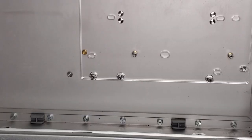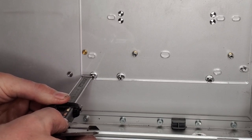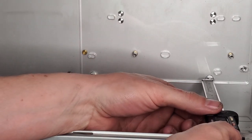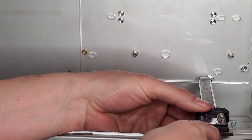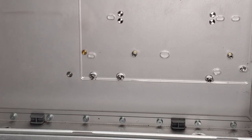I'm going to take my calipers here and measure the depth of what needs to be cut off. It looks like about six and three-quarters millimeters — oh, that one's taller, that one's nine. Six and a half, six and three-quarters... this one's nine. That's weird. I think what I'm going to do is mark it with my Sharpie and then dremel them off.